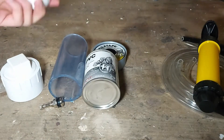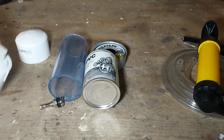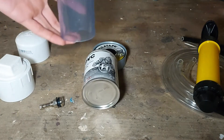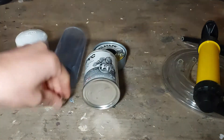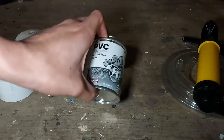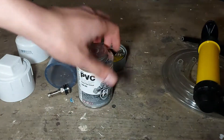What you're going to need is a 2 inch PVC cap, a 2 inch PVC clean out adapter with a plug, and a piece of 2 inch clear PVC — this is the hard to find item, but you can get a piece like this on eBay for a few dollars. You'll also need a bolt-in tire valve, which auto parts stores should have, and some PVC glue. You don't need primer since it's pretty much no pressure.